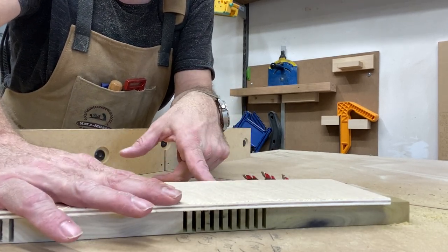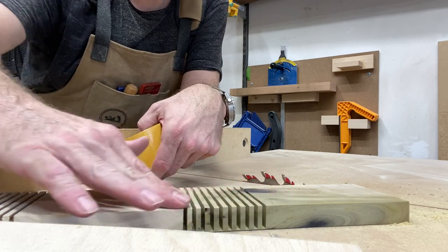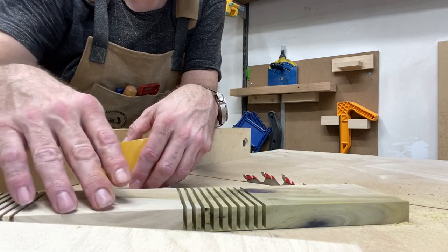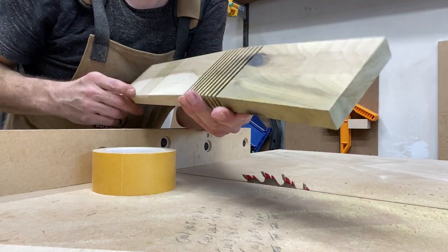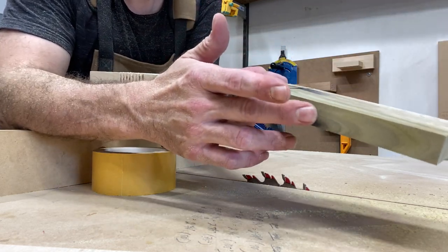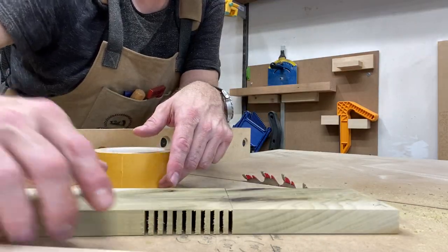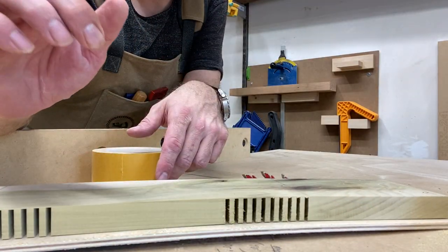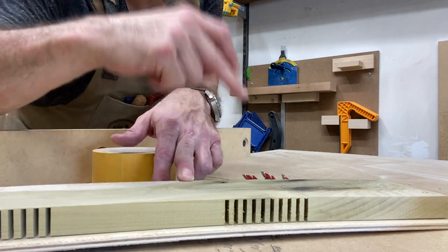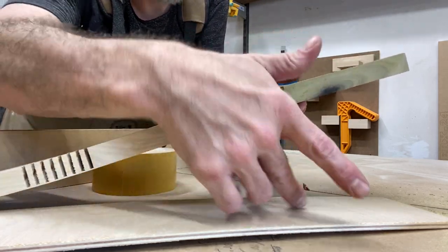If you're feeling awfully cautious, you could do two strips. Tape here, tape here — you don't necessarily need it in the middle. Then you do the sip rip where you set your fence to just one thirty-second of an inch within the actual width of this board, and rip it through with the kerf fence facing down on the plywood on the cast iron. The blade will come through, hit the back, and that strip of material you've left behind will protect the kerfs. You just don't want it hitting from the bottom.